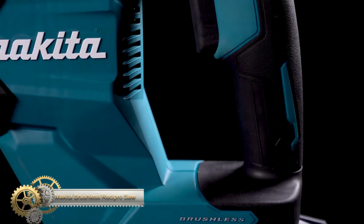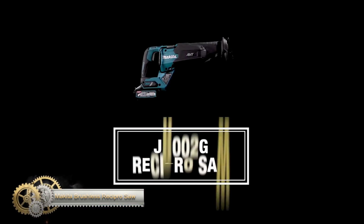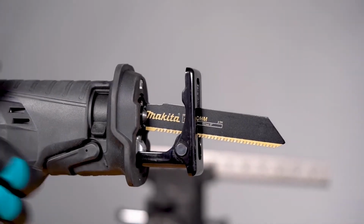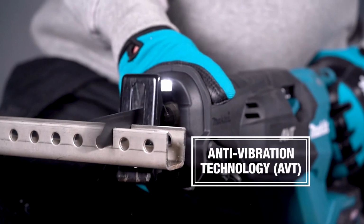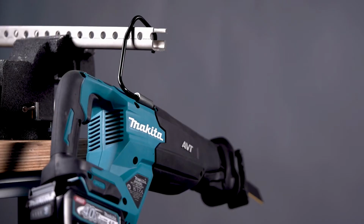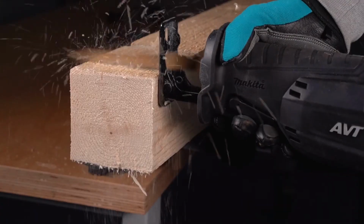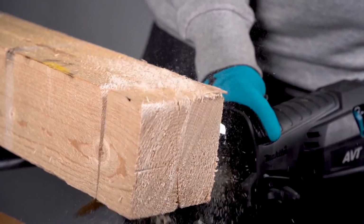The Makita Recipro saw is a high-performance cordless saw with a BL motor, constant speed control, and orbital function. Its lightweight design and horizontal crank-type counterweight reduce vibration for less hand fatigue. It has a 32mm stroke length and variable speed control for efficient cutting, and an extended blade life in stainless cutting applications. The blade ejection lever is conveniently located, and the shoe features an anti-drop mechanism for easy removal. The ergonomically designed handle ensures comfort during difficult cutting applications.